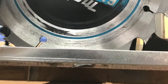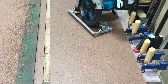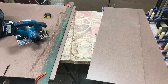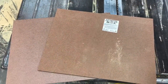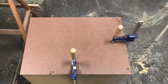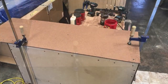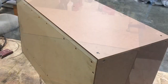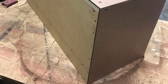I'm getting ready to cut some of that quarter-inch hardboard. I'm setting my depth on my saw. Made a couple of passes on my table, which is actually a door. Straight edge clamped into place. Now I can go ahead and start cutting my pieces around the box, because this is what I'm going to use to allow me to tuck my carpet around my edges. Clamping, temporarily screwing into place, no glue. Then I router them or flush trim them all the way around where everything is smooth.